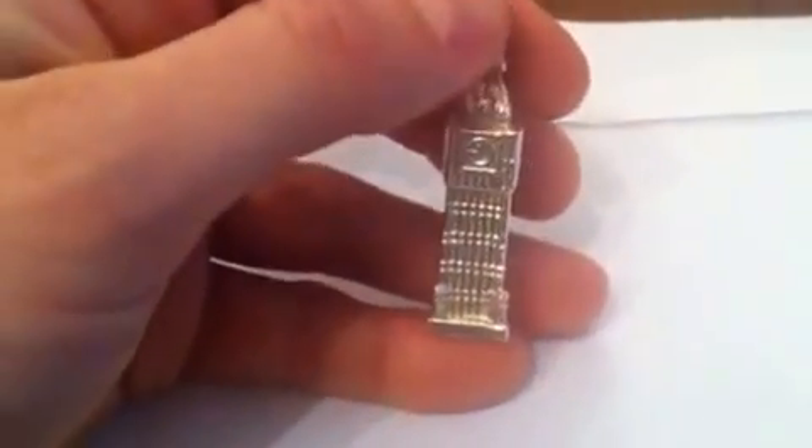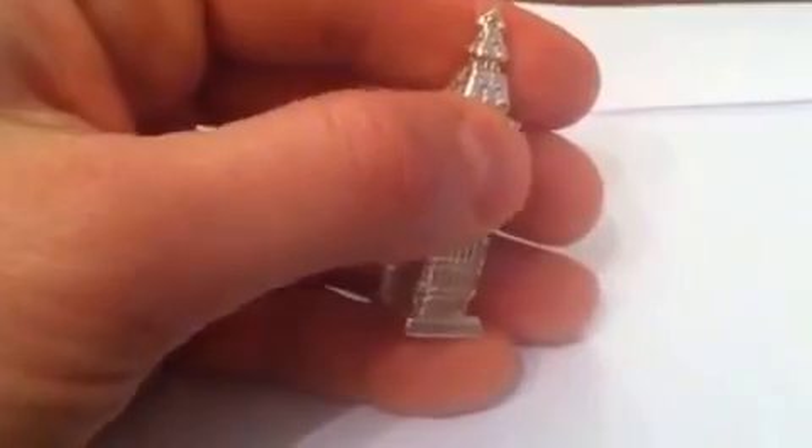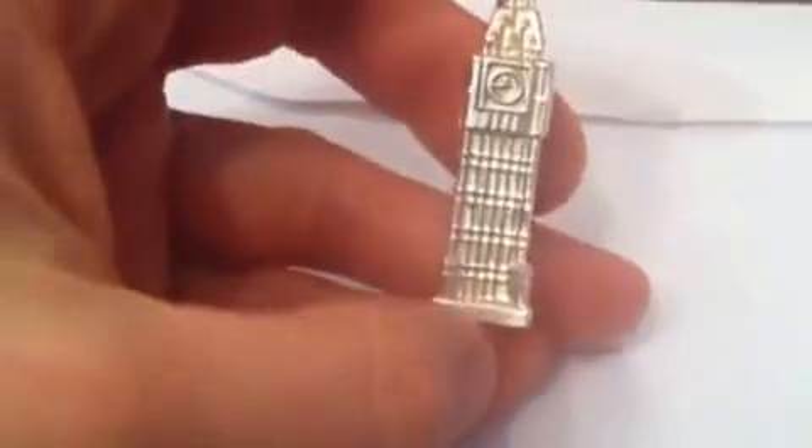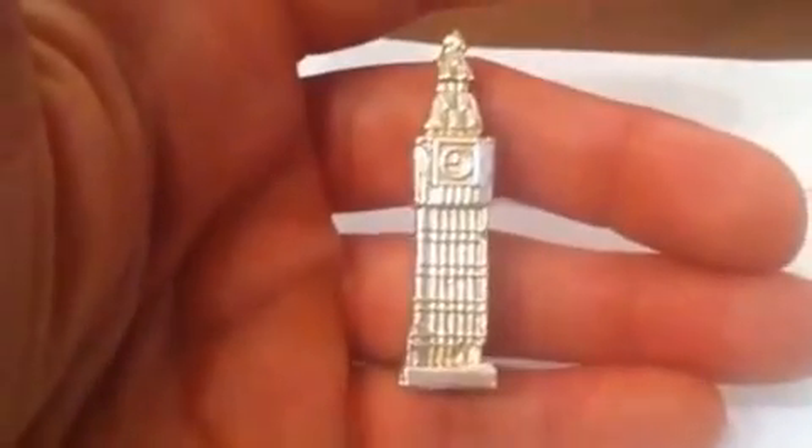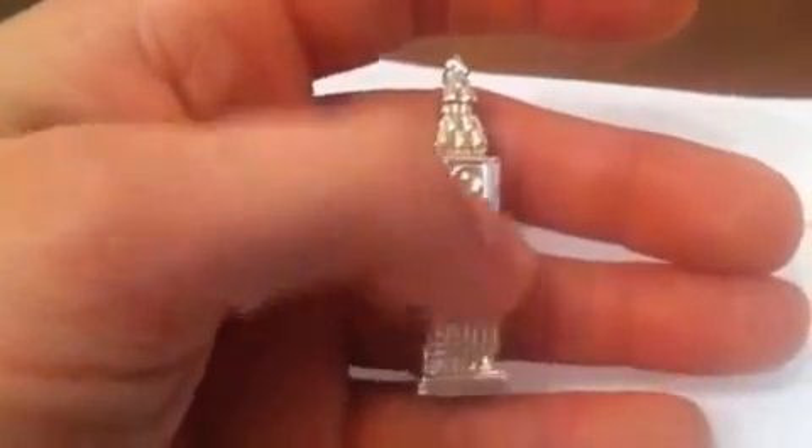So here's where we're at. I've not finished it yet — I've still got to level the bottom. The thing is it was an open cavity here so it's hard to get it straight, so I've been filing that. Clipped off the top — I've just got to file that to a point. It's come out not too bad. There's a bit missing just there on that corner, which is disappointing, but I could see by the mold that it wasn't going to turn out the best, so I just water cast it anyway. I've got some more work to do on it, or I might just leave it there and melt it down.